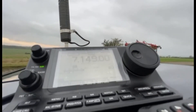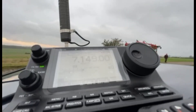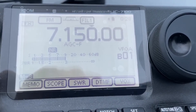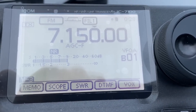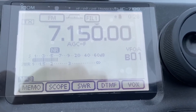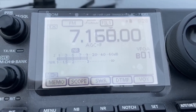Now I'm going to try to get some contacts, but I just wanted to show the tuning method. It was a bit complicated to set up, so I put the radio on top of the car and did it in one continuous shoot. I've got it set up in FM mode again — only on 10 to 12 watts power. I tune them up in the middle of the voice portion. I've got it very well tuned, but I want to show you what happens if I take it up to 7.200 MHz — the top of the band.